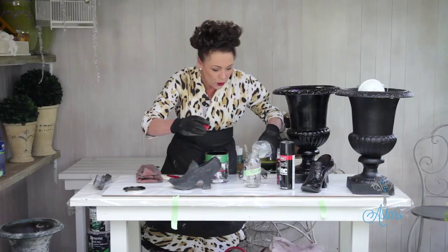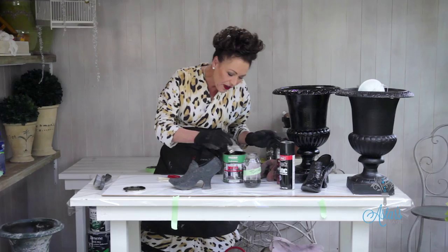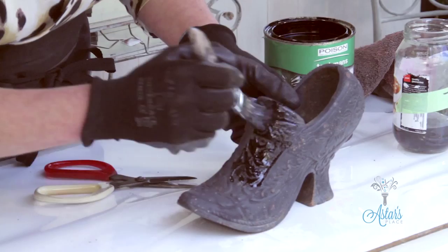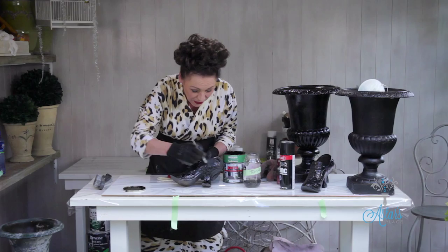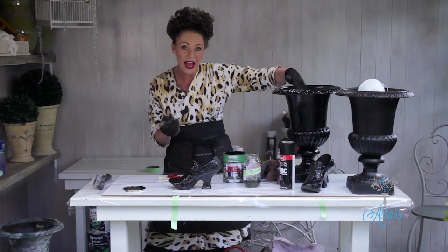Get your paint brush and give it a wipe down. The enamel is a little bit thick, so when you're putting it on, be careful that you don't have too much paint on your brush. It's just a matter of brushing the whole thing over. The reason I love enamels is you get this beautiful shiny exterior, and that looks fantastic outside. Because it is cast iron it will rust, so the prep you do now is going to determine how long these last outside.